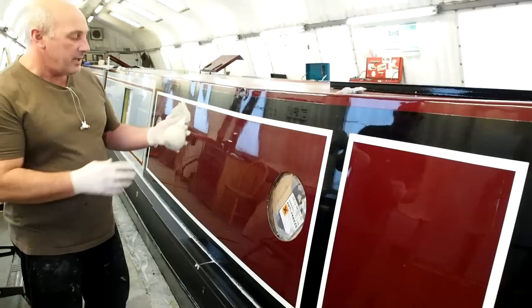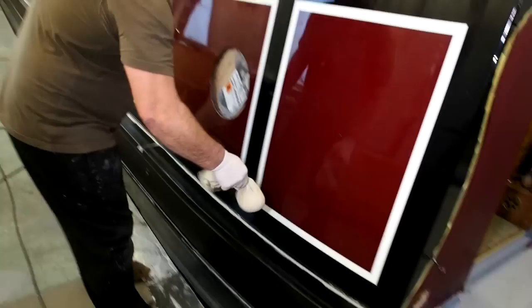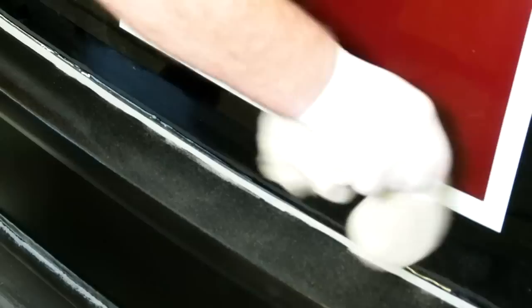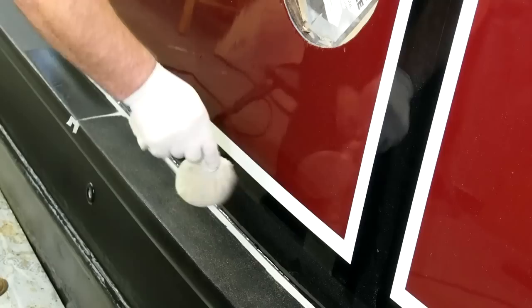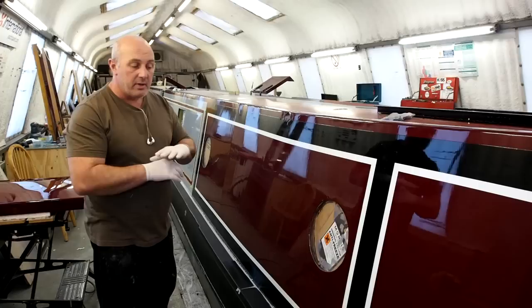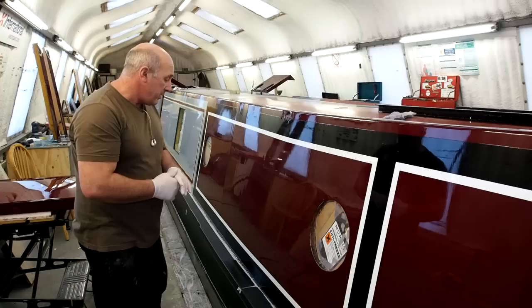I've got a little bag of sand — a couple of pieces of muslin with some baked dry sand inside — and all we do is just shake that out. That gives us a nice almost suede effect finish, which will look very nice when this dries out and has a second coat over the top. You could literally shovel the sand on if you wanted, and obviously it'll stick wherever the wet paint is. I like doing it this way — I think you get a little bit more control and a nicer finish. So that's all there is to it: a layer of wet paint which is sanded, then tomorrow we'll hoover it down and apply a coat over everything to seal it all in.